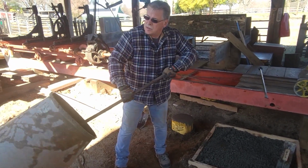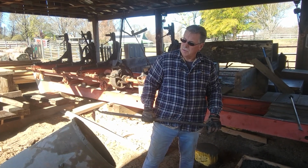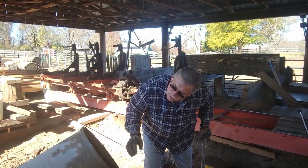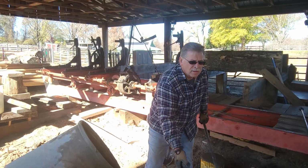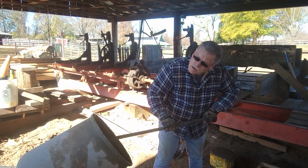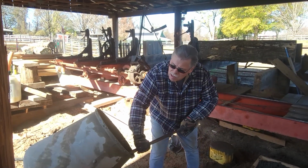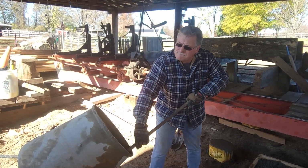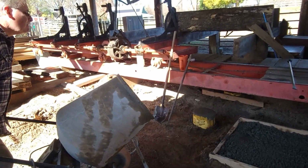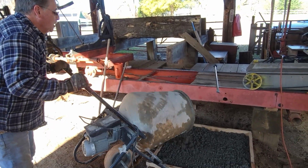Okay, well, what you don't see here is that sonotube right behind Phil is already full of concrete. And then one behind it, we filled it with concrete. So what we did is we used the 5-gallon bucket method to fill in the other one, and it worked out actually pretty well. So we had extra concrete lying around. So we decided to fill up the stairs with it. So we quickly framed up a little stair thing here, and we'll finish that off in a week or two. We'll put some wooden stairs on top of it, but it'll make a nice base for it. And we had some extra rebar. We put some extra rebar in it too.